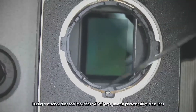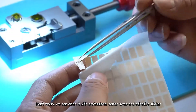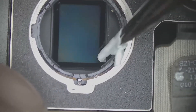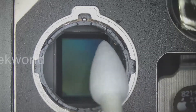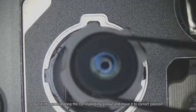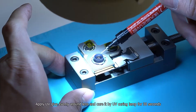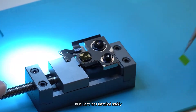During operation, dust and impurities will fall onto the camera photosensitive glass lens. Don't worry — we can clean it with a professional cotton swab and adhesive sticker. This is the new blue light lens. Put it into the camera along the corresponding groove and move it to the correct position. Apply UV glue evenly around the lens and cure it with a UV curing lamp for 30 seconds. The blue light lens is now installed stably.